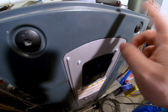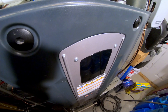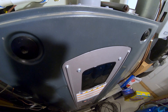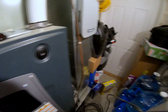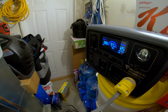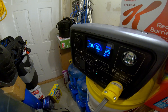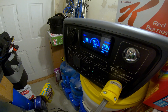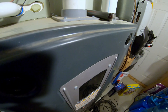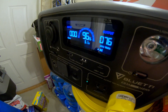I'll cut away to go inside and raise the thermostat to trigger the furnace. The induced draft motor is starting — it's pulling 126 watts. Then the hot surface igniter fires — that pulled quite a bit of power momentarily. Now with the burners going, it's only pulling 76 watts.